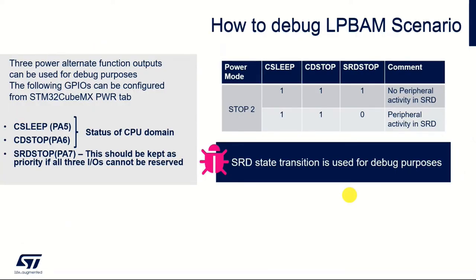If you remember from Anders' workshop, we turned off debug support in low power mode, and that's important to remember because the debug block itself takes quite a bit of power. When you're running in low power mode, you're going to want to turn that debug block off. But because you've turned it off, you don't have access to the internal states of the core, making it very difficult to debug. To make life a little bit more simple, there are three configurable signals that can be enabled in a debug mode that doesn't rely on the JTAG connection, which will indicate the states of the two power domains — the CPU domain and the smart run domain.